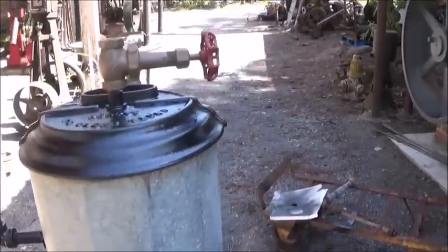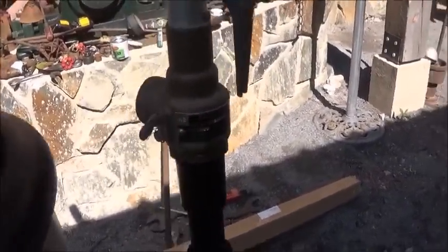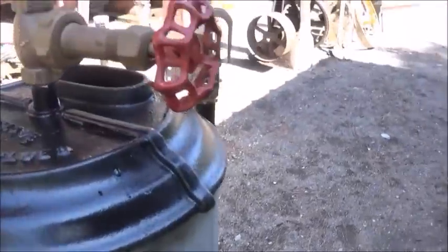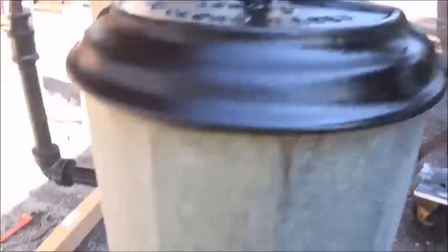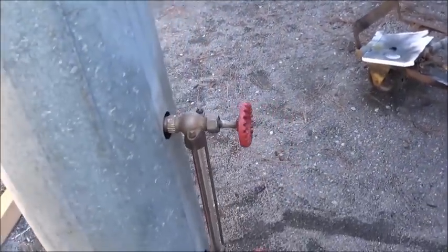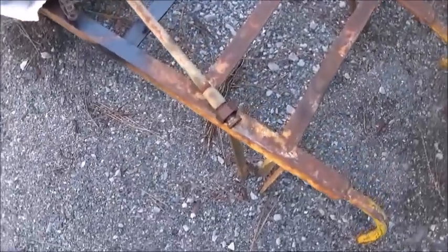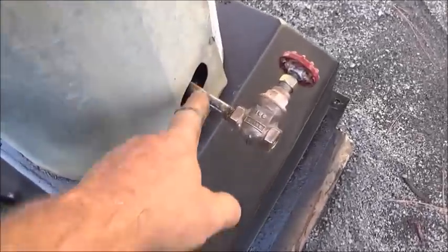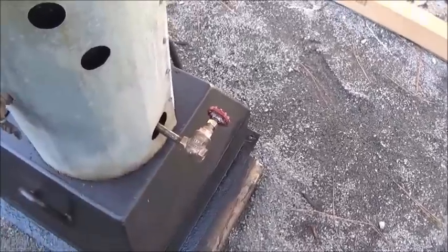And let me see, we've got our 80 pound pressure relief valve, new old stock, ready to go. Shouldn't have any issues there. Cleaned this valve up, changed the pipe out in here that was galvanized. This is all steel also, which none of this is the same pipe, and most of it's laying right there actually, but most of it was galvanized, as you can see. So let me see, of course this is different, and I actually changed this small pipe out, not because it was galvanized, because the other one was pretty rough, and put this little valve back on as a drain.